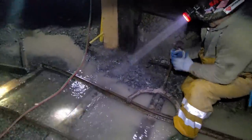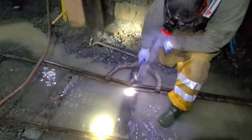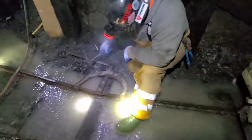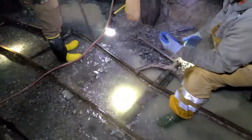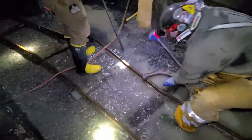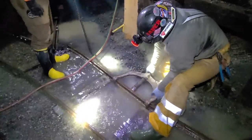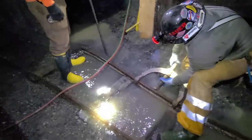The rail is heavy and thick, but it's also surprisingly flexible. The metal, especially in rail that's more than 100 years old, has a memory. You've got to beat on it with a hammer after you've bent it to avoid having it snap back into place after you remove the Jim Crow. When you're bending the rail for something like a switch, you're going to have to bend it in more than one place. So it's a good job for the new guys or your strongest guys, because it's a lot of work.